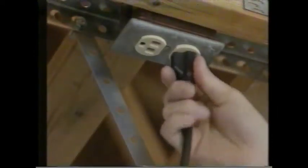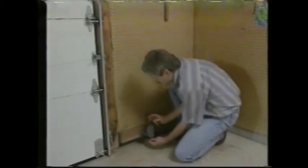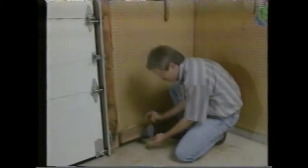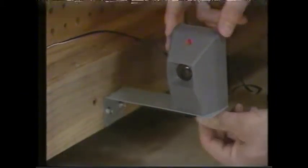Connect the power by plugging the unit into a grounded outlet. Once the power is hooked up, you can adjust the beam sensor by loosening either the thumb or adjustment screws and pivoting the unit left or right or up and down. When the alignment light comes on, pivot the unit around until you find the center of the operating angle, then tighten all the screws. Finish tacking down the wire, then loop and secure any extra wire in a safe location.